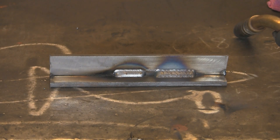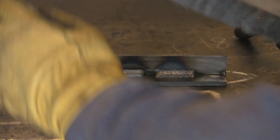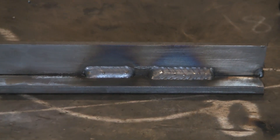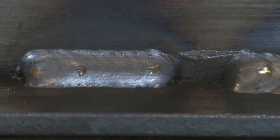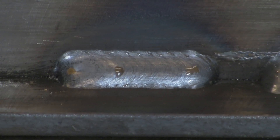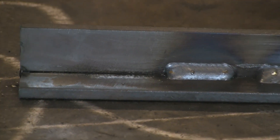This is the sort of speed I'd probably use coming downhill, but we're on the flat. See the difference — it's a bit more raised, it's a bit neater, a little bit more weld filler even though I was going a little bit faster. Still no undercut because I haven't changed anything else. If you listen, the sound is the same on all three welds — I haven't changed any settings except my travel speed.